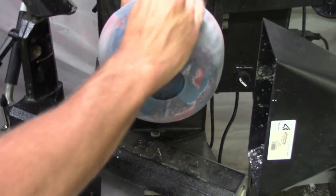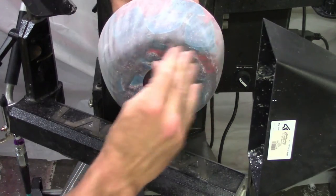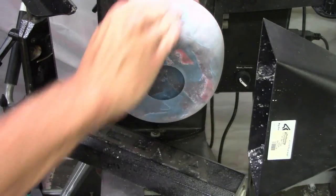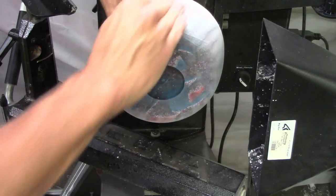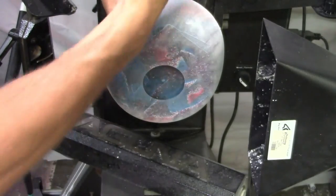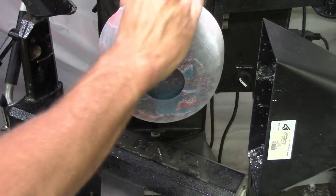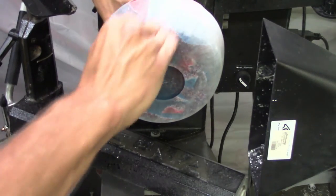Frankly, I'd rather not mess around with too much hand sanding if you're going to be using the inertia sander or a drill. I think on most projects you can just get away with using those things and move on. But what this does is give you an indication when we move up to the 400 grit on the next step, doing the outside of this bowl: if there are any diagonal or straight lines, then we haven't sanded enough. So it gives you a visual cue that, okay, I can move on, or I have to do a little more sanding with this grit.